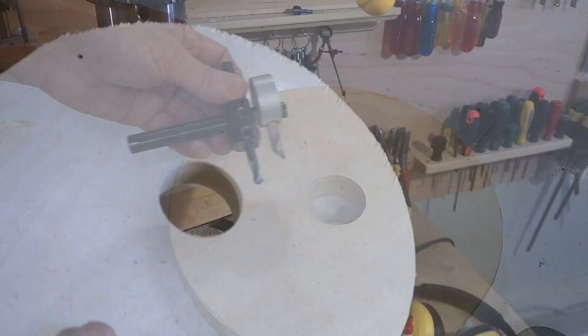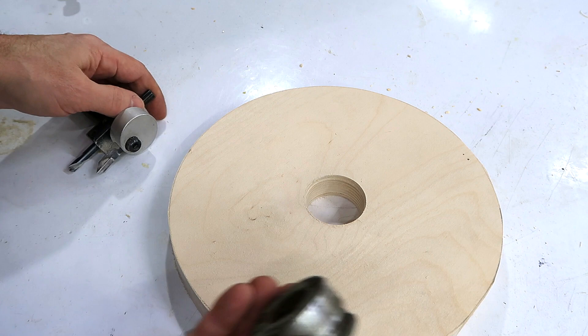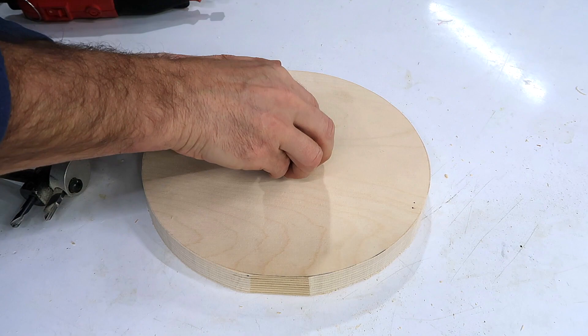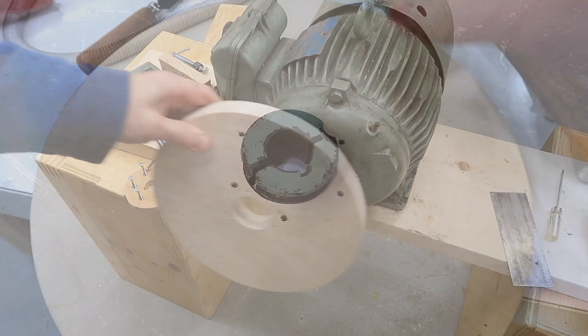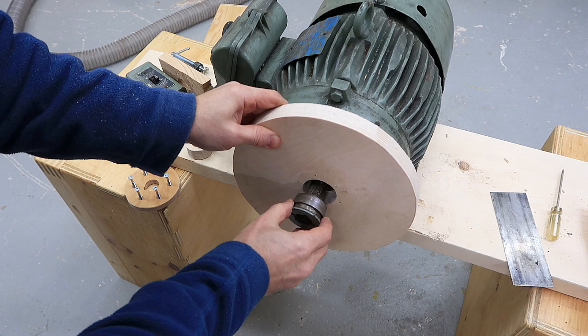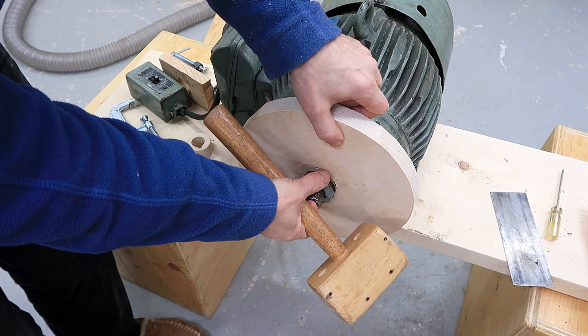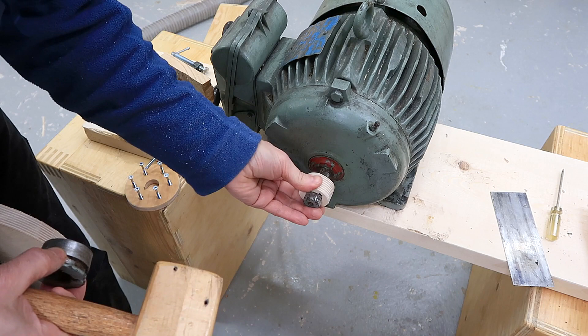This cutter naturally cuts slightly conical, so I'm actually pretty close already to the shape I need for this part. I made this flange to really help press that in there, or at least keep it pressed in so it doesn't come loose. To tighten this, I could just hammer this thing in there and have a spacer behind the pulley, but then how do I get it off? I can hammer the pulley, but if this thing comes all the way back I'm out of space. So I made this spacer here, which goes against the rotating part back here, and that will prevent this thing from sliding too far back, which means I'll always be able to hammer on the pulley to get it loose.